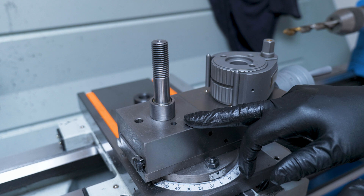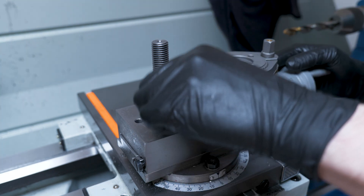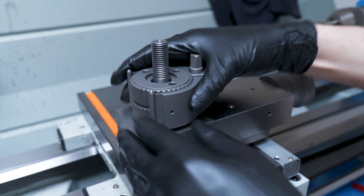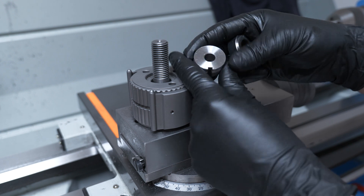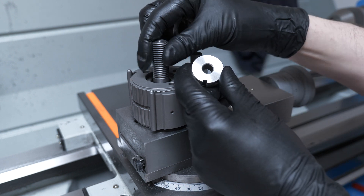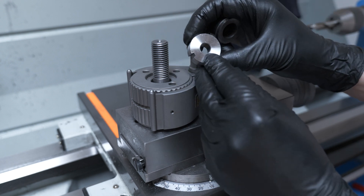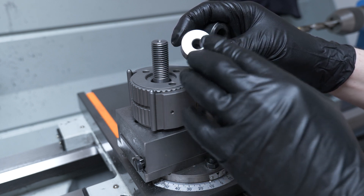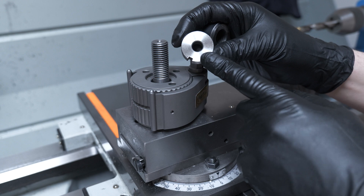We got the hole drilled — I was massively overthinking and overcomplicating the process. Doing it on the drill press turned out fine and we got a nice suction pop. This is almost ready to start using — it now locates in place. Last thing to do is bore this out to 16 millimetres so we can put this over the original 16mm stud. I think the size A from Peewee Tools is for a 10 or 12mm post, so let's enlarge this now.